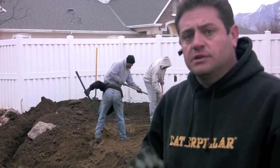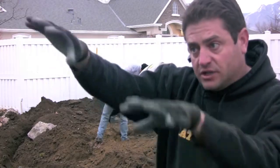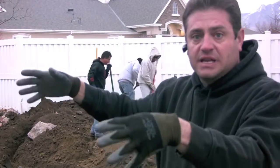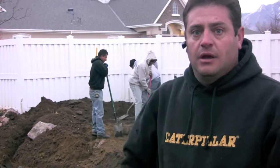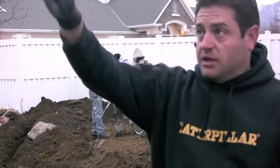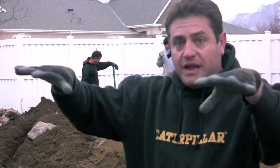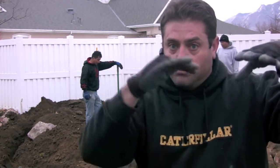One of the real tricks with these water features is making sure it looks like the water from the waterfall actually eroded the boulders that you see. You don't want the boulders humped up over the sides making it look like somebody just put boulders on the sides and put water down the middle. In a real water feature, the water is coming down from the mountain, going through the dirt and exposing the rocks and boulders — that's what makes your waterfalls. The more realistic water features I've done are more level with the elevation of the soil with regards to the rocks and boulders, and the stream is below that level.